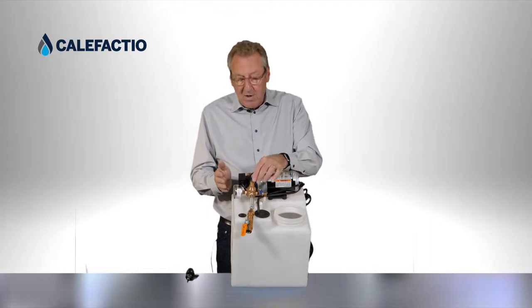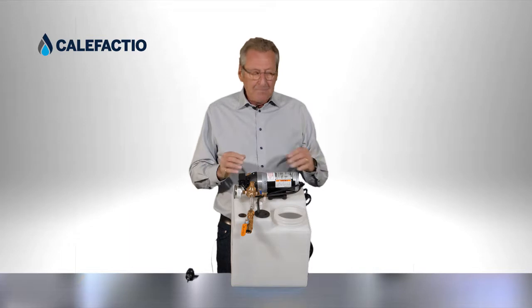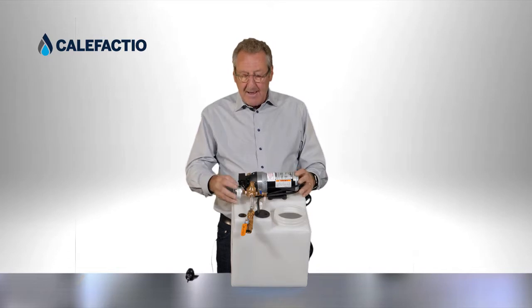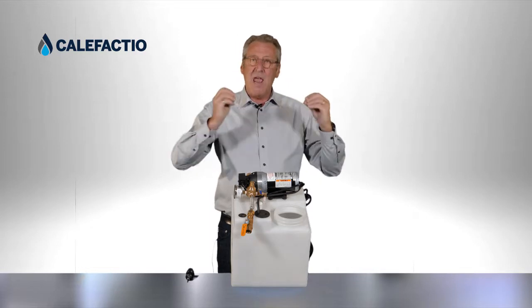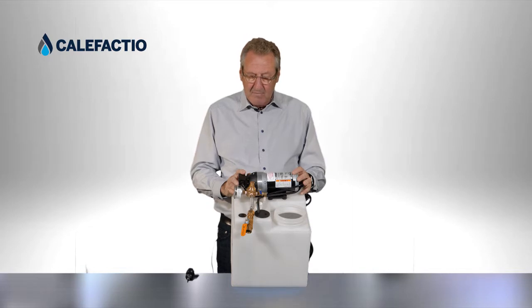It might go, let's say, to 15 psi — we want to store about 3 psi. That will represent a quarter of a liter, a few ounces of liquid. We don't know exactly, but we know that we've got some liquid in the expansion tank that will be used to replace the air trapped in the system going out through all the air separators.